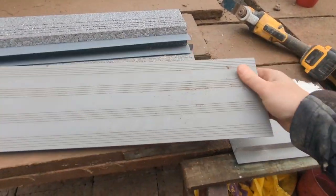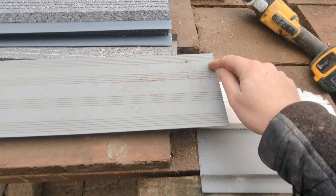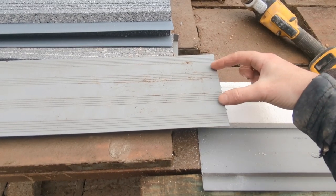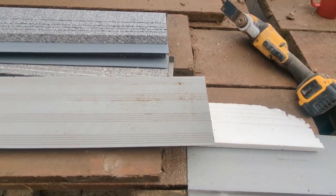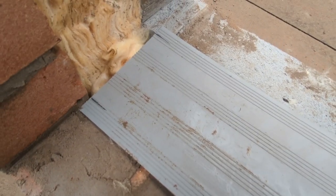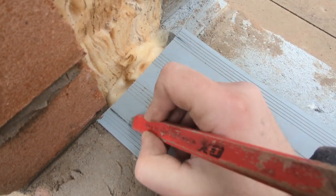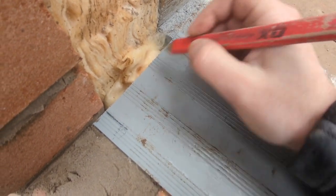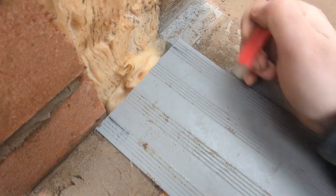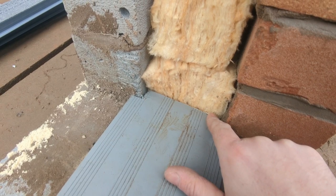So that is brickwork to brickwork plus 50mm. Now what we're going to do is notch out 25mm from each corner like that, so then the bit that sticks out - almost like a mortise and tenon joint if you like - goes into the cavity. I'll cut it out and show you, it makes a lot more sense. As you can see, I've offered it up to the cavity and marked exactly where the cavity is, and I'm going to come down 25mm and cut that bit out on both sides. Then you've got something where the cavity closure projects into the cavity about 25mm.